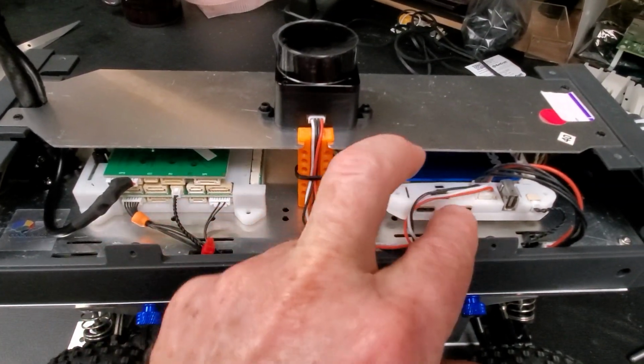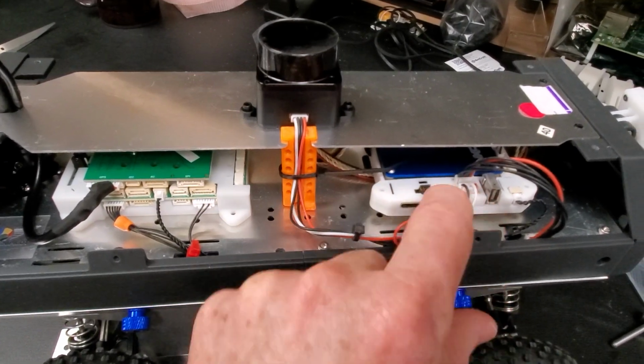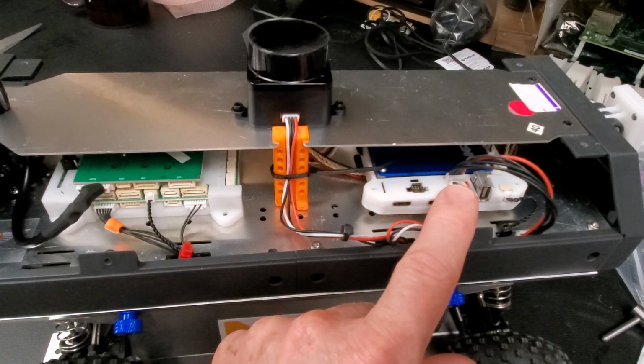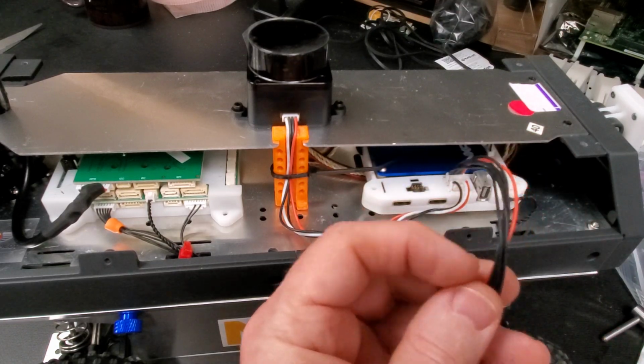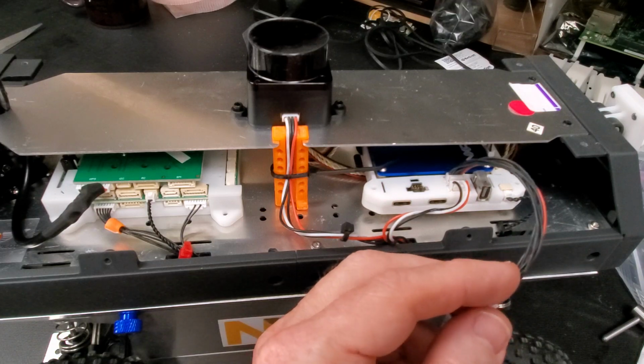And then that plugs into the forwardmost UART connection on the NavQ Plus. That's right next to the IX Industrial. And then this is the serial port connector. It's not the full debug connector that the other one is.